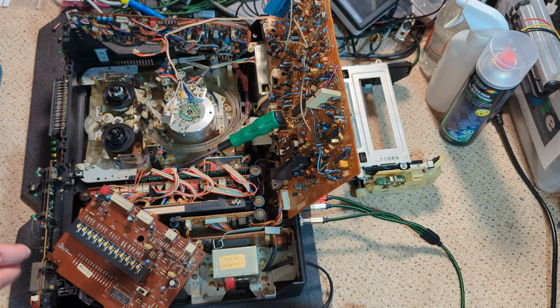Which I think has been roughed up at some point. So rather than putting a tyre on, they've just roughed it up, probably towards the end of its life, to get it going for a bit longer, sort of thing. So yeah, that's fair enough. So yeah, I'll change this, give it a bit of a clean in there, and take it from there. So we're all cleaned up, and new tyre put on there. They're actually quite narrow compared to the originals, but they'll do the trick. I've checked the spools, cleaned them, and I've lubricated this, the actual brake mechanism as well.